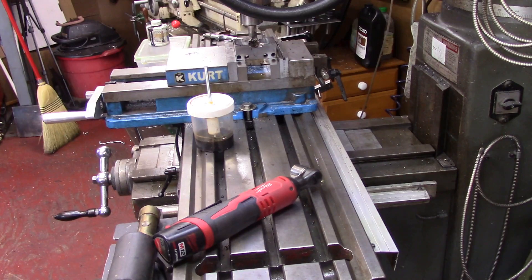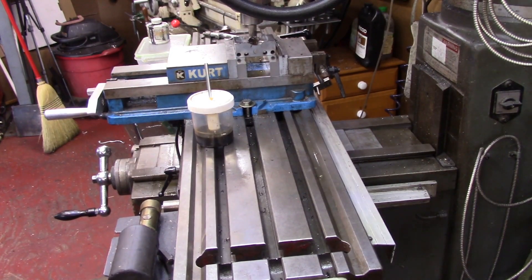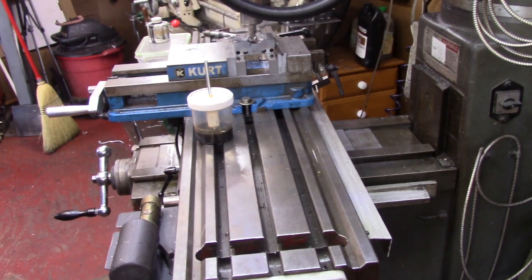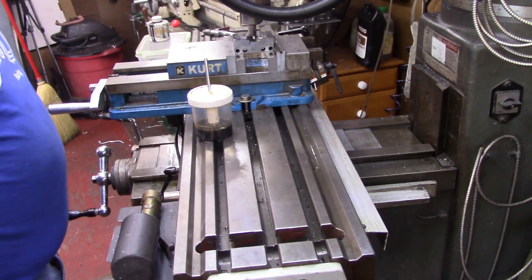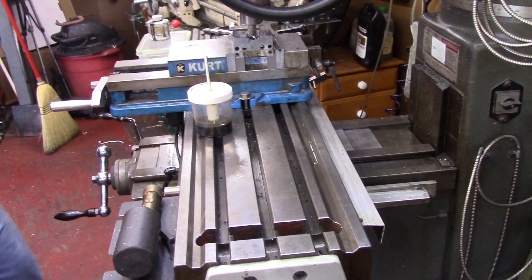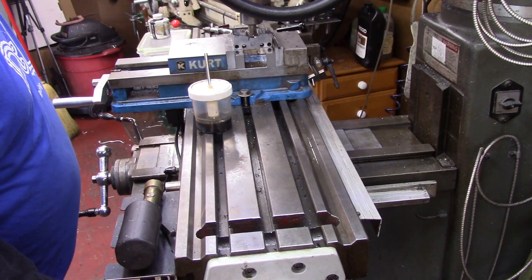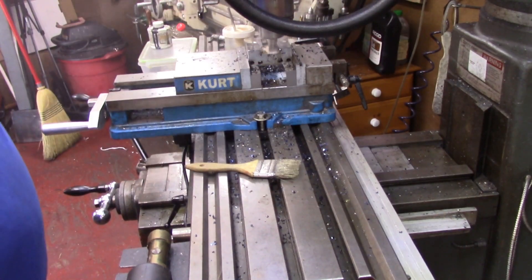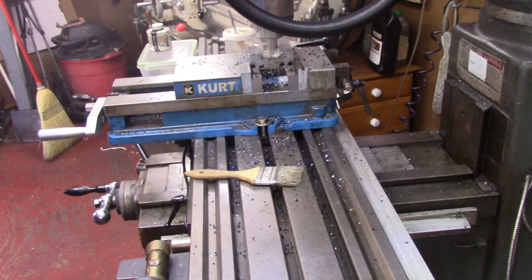All right, now I'm just taking that very first cut. I'm going to take a hundred thousandths off the center to see what we've got to work with — see if we touch anything on the sides and get an idea of what we've got. We may have to go up and down just to get a place to work from to measure. The idea is to see if I can get a place I can measure both sides of this so I can do the milling. Looks like I've got it. What you're seeing is my very last depth pass. I'm going to take a still picture when I get this done with the cell phone and let you see how good it looks.